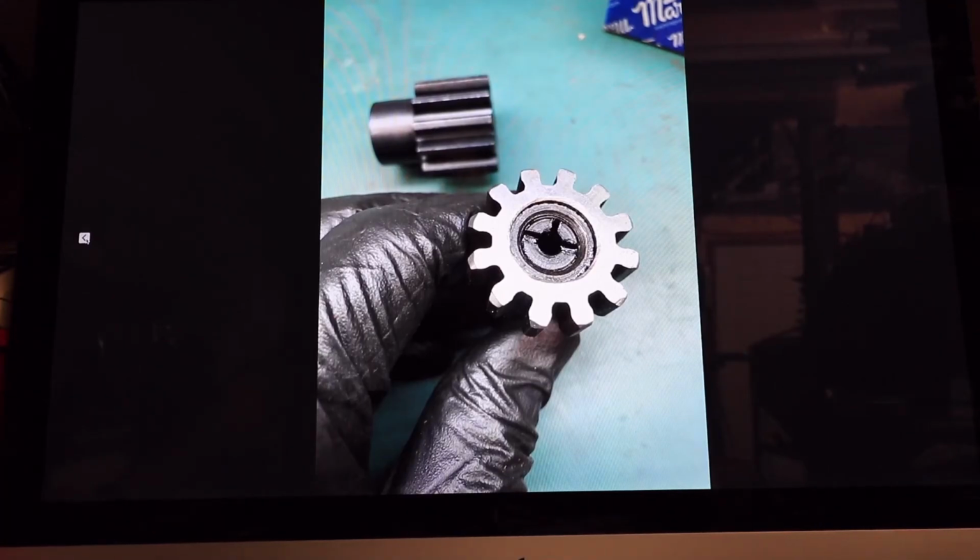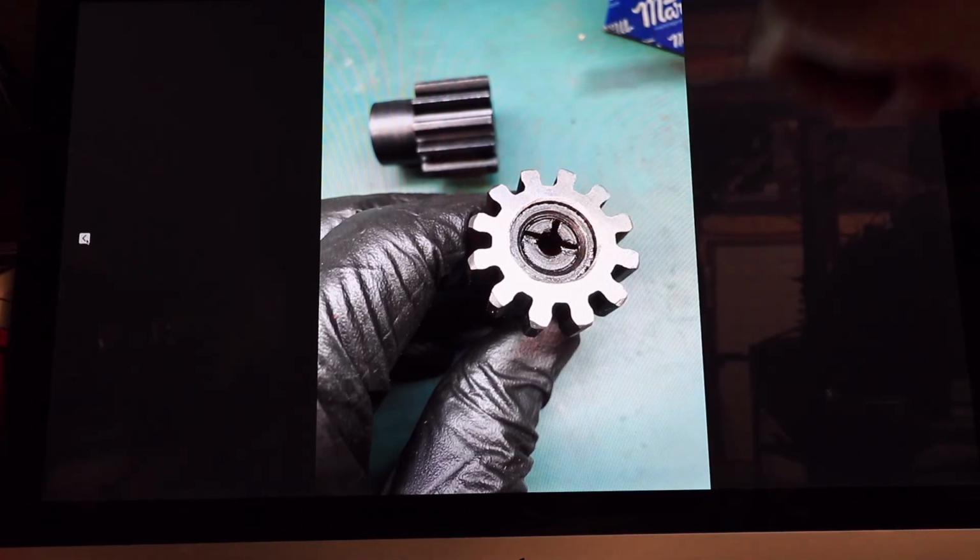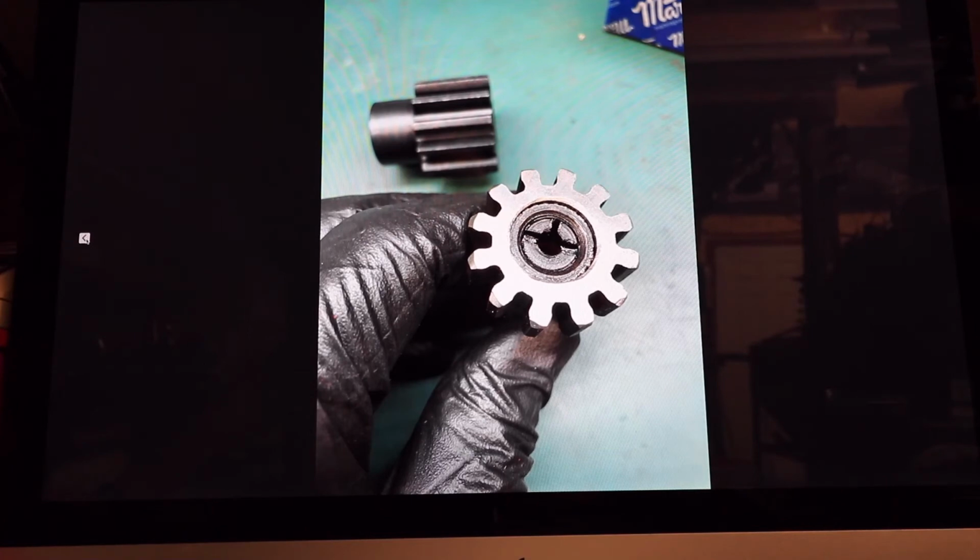And here again is a picture of the final product. Everything assembled. Of course, there's a little rod that goes through here, the little push rod. But you put that all in there when you stick it back in the engine. And he has since stuck it back in the engine and gotten it running. We ended up having to put rings in it and stuff like that. It had some stuck rings, had a lot of blow-by. We went ahead and pulled it apart and found that the rings were stuck in their grooves, and he's going to go ahead and order up some new rings for it.